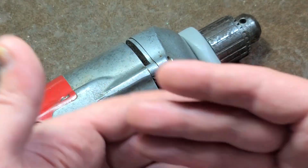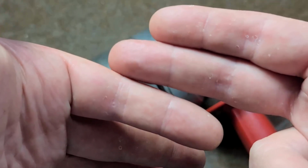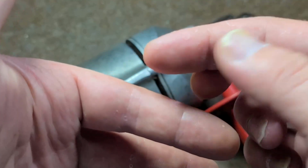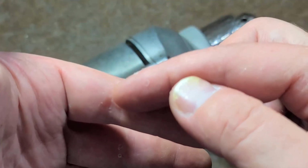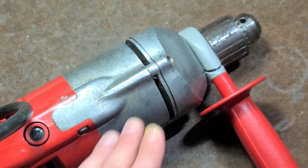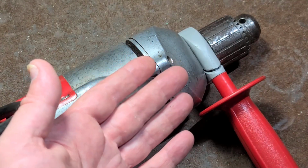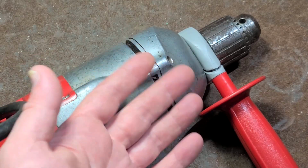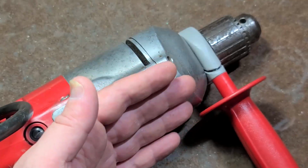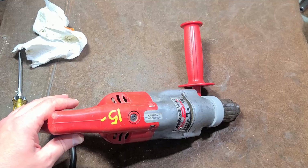The problem with the gears getting cockeyed is that you have a misalignment, and so you have one part of the gear where most of the pressure is. So it concentrates a bunch more load on a small area. That portion of the gear starts wearing out faster, and as it wears, that pressure point just crawls across the gear. And gear alignment is most of what determines the lifespan of the gears, not just the metal or the heat treatment. If they're really well ground and aligned perfectly, then their pressure will always be nice and even, and that will greatly reduce the wear.